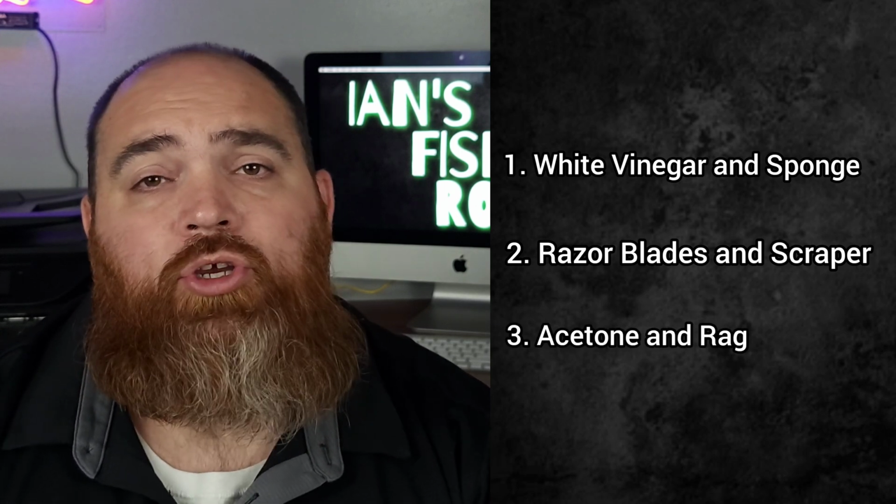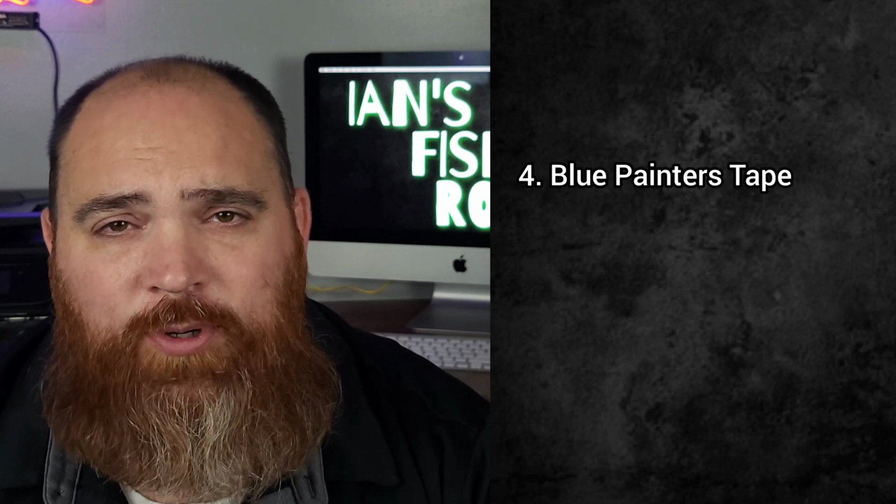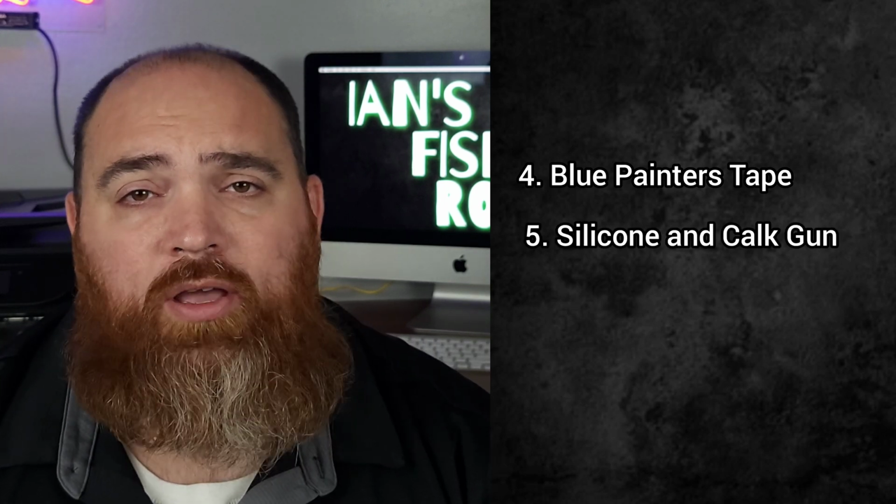So there's some different tools that you're going to need for resealing your tank. First, you're going to need some vinegar, white vinegar, and a sponge. You're going to want a razor and razor blades. You're going to want to have some nail polish remover or acetone and a rag. You're going to want to make sure you have some blue painter's tape. I like to go with the blue. You could go with the green, but typically the blue is cheaper, so I like to have the blue. And lastly, you're going to need some silicone and a caulk gun or silicone gun.